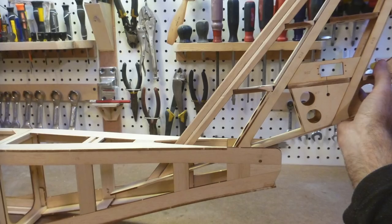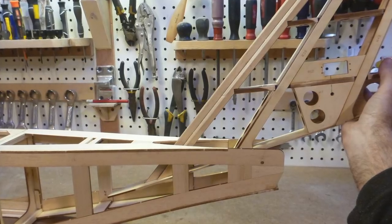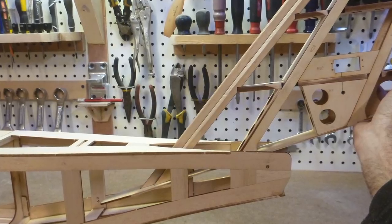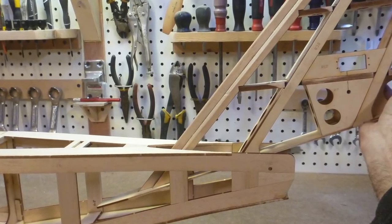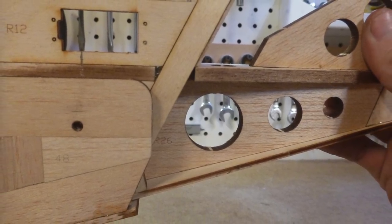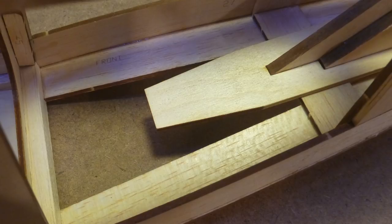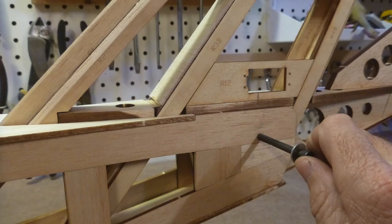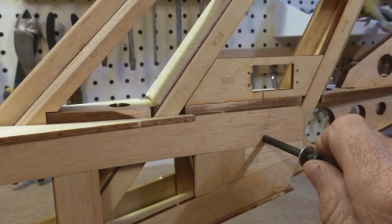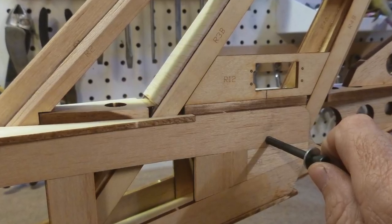Insert the vertical stab into the fuselage and observe where it touches. You may have to trim just a little wood from the top of the fuselage, but you should get it to fit in very precisely in this position. It's very important that it lay flat on the bottom of the fuselage above all else, so that the incidence of the horizontal stabilizer is not affected later. If the hole for the rear fuselage bolt has not already been drilled, it can be done now, with the vertical stab held firmly in this position.